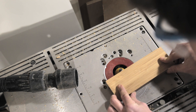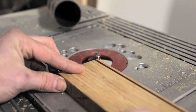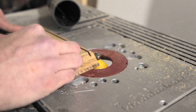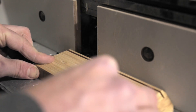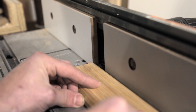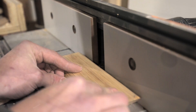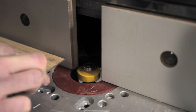This part is optional, but I used the router to give the edges of the light a nice clean look. Making the first light, I routed the front outer edges before the glue-up and realized afterwards it was a mistake because the 45-degree miter corners got a lot of tear-out going through the router bit. Next I used a rabbeting bit on all four sides of what would be the back of the lamp to cut the rabbet for the back panel — I do recommend doing this before the glue-up because it gives you square corners.